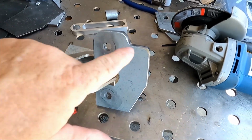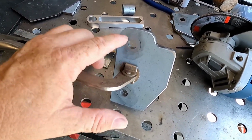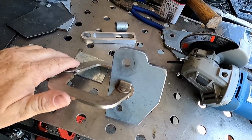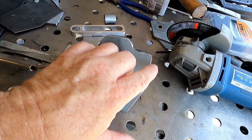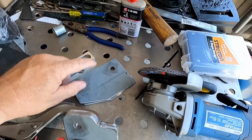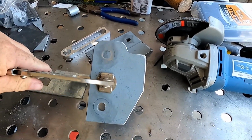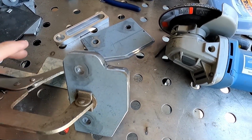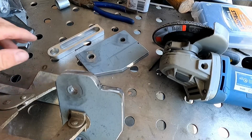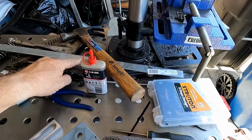So this is what I came up with. This notch here, and turn the radius right there. I've already tried it on the shock before I ground it, and it gives the shock enough room to travel like that. So this should help a lot. If I need more, I can do it later after I add the pieces going forward. I still need to do it to the driver's side parts, but I just want to show you what I'm doing. The cuts I made, I lined up the holes and clamped them together and cut them. So I'm going to do the same to here, but I'll spare you the video of watching it, and I'll just do it. And then I'm going to use this flat bar over here as the part that goes forward with the spacer.